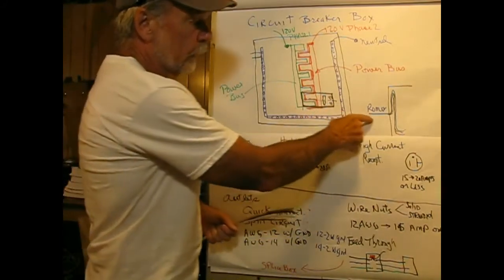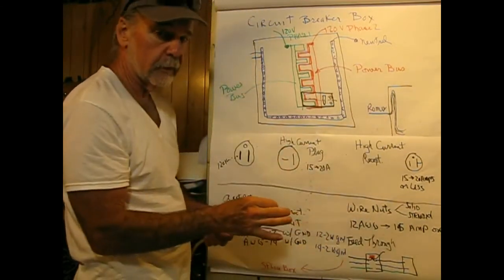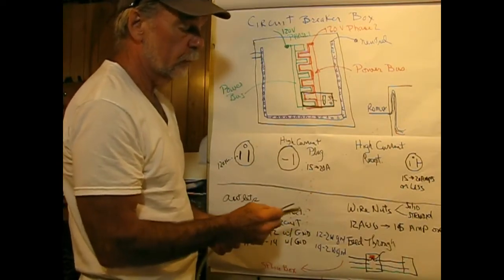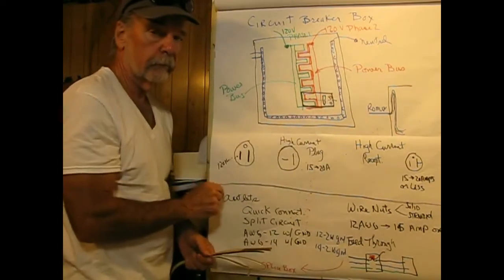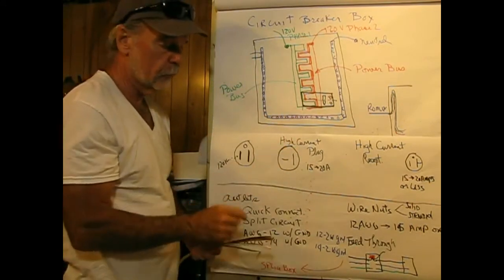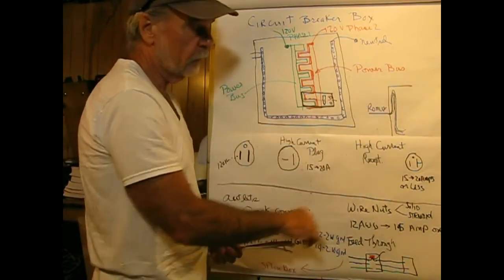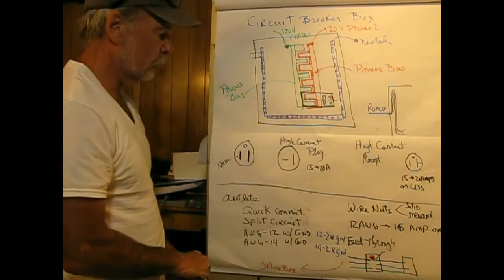Once that happens, you serpentine the wires, you leave plenty of slack, and then you pick up, in this case, the black lead is hot, meaning 120 volts, that would go to a circuit breaker screw, and then the white lead, which is neutral, and the ground lead, which is bare, would go to this. You never put two wires under a screw. If your box ever gets inspected, if you want to sell your house, you'll get a hit on that. So it's one wire per screw, and these are designed so you can really crank the screws without worrying about stripping them. So you often see boxes and they look terribly not neat, and that's done for a purpose, so you have flexibility inside of this. And it doesn't really cause any problems whatsoever.